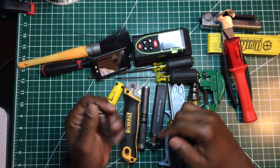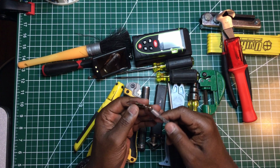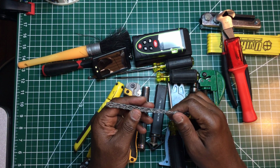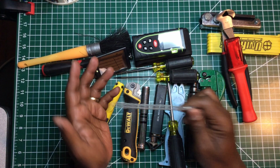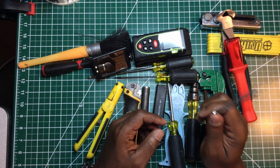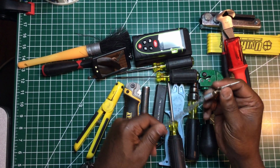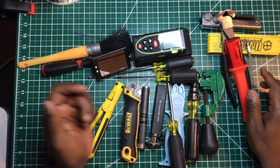Like I just said, I'm just pulling out the stuff that I have with specialty tools that I had around my bag, but if you're going a long distance and you're pulling through a crowded conduit with other cables, this will come in good too. This comes in handy too. Also, the old-fashioned way with the tape, making your own eye in the top for your fish tape to pull it through. Either or.